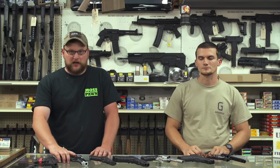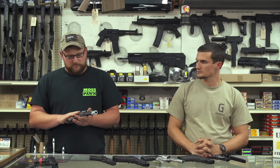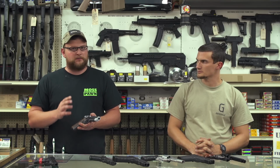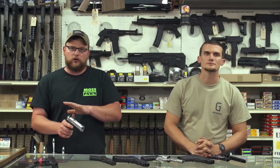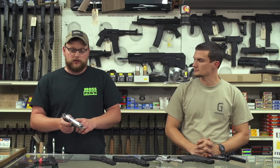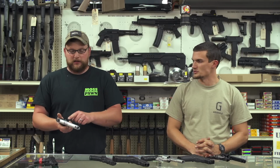We're going to start off with the 1911. Many of you guys know the 1911. It's a very iconic and popular handgun. However, there are certain safety and etiquette things that need to be considered about a 1911 in order to make sure that you're not going to damage the firearm. You should avoid slamming the slide and letting it just ride home. You can most certainly damage the barrel link. Also, the idiot scratch that's on 1911s, what we call it, in disassembly.